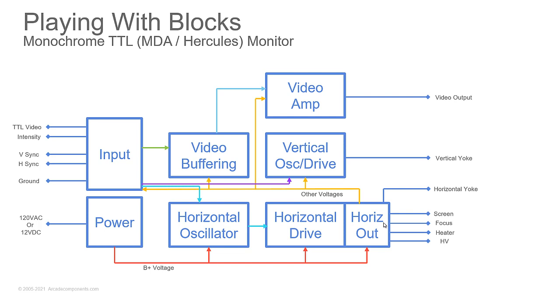Now, these diodes are high-speed diodes. You're not going to replace it with a 1N4007. You know, that's a standard 1-amp general-purpose diode. It's not fast enough. It will fail. It will fail fast, almost a blink of an eye in these very high-frequency applications. Because remember, horizontal sync, 15 kilohertz, 24 kilohertz, 31 kilohertz. That's the frequency of that voltage coming off that tap on that flyback. So you have to use what they call Schottky type diodes. They're very high speed, on the order of nanoseconds recovery time.